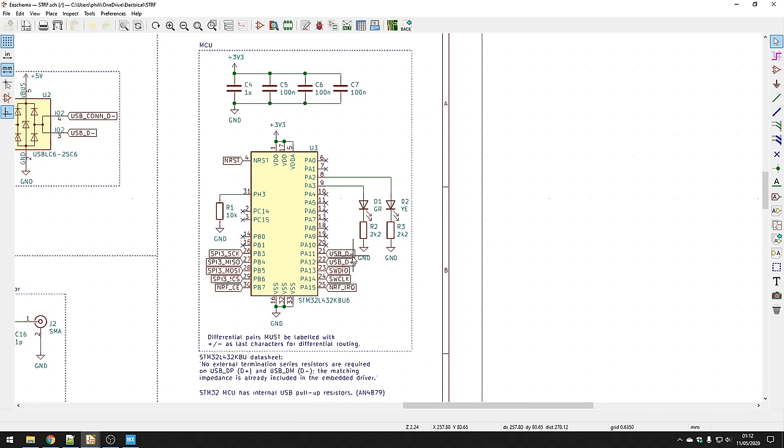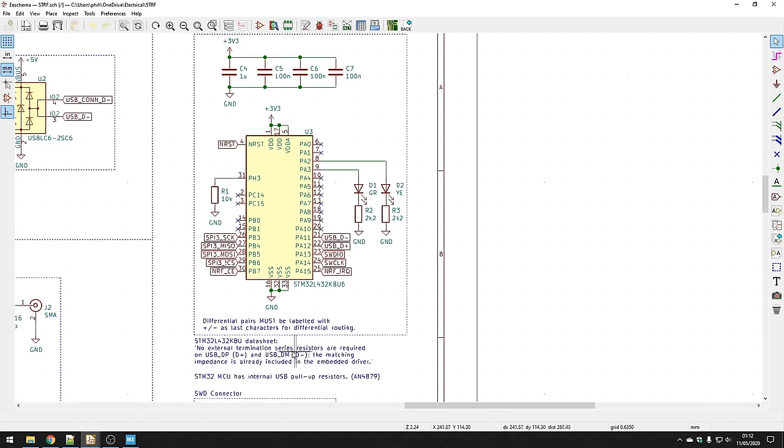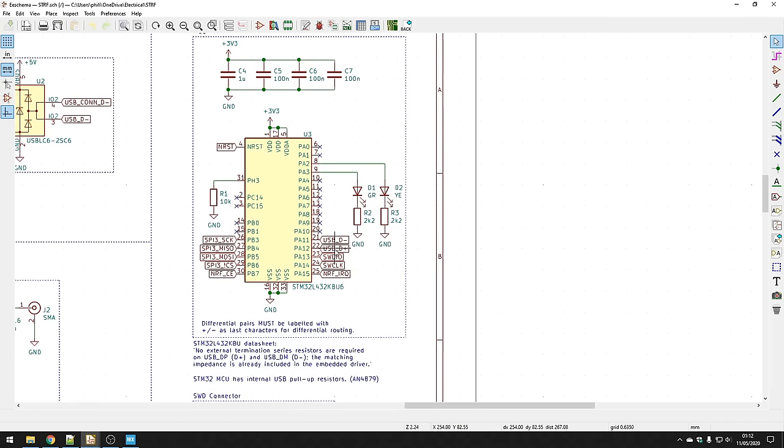For USB, it's a bit hard to find in the datasheet, but the USB differential pair inputs — USB D- and D+ — don't need any external termination or pull-up resistors. You'll normally see 22-ohm resistors in series with the D- and D+ lines, but for this STM32 you won't need that; they incorporate it into the chip. To indicate it's a full-speed device, you'd sometimes need a D+ pull-up resistor of about 1.5 kilohms, but that's incorporated into the device as well, as given in application note AN4879.